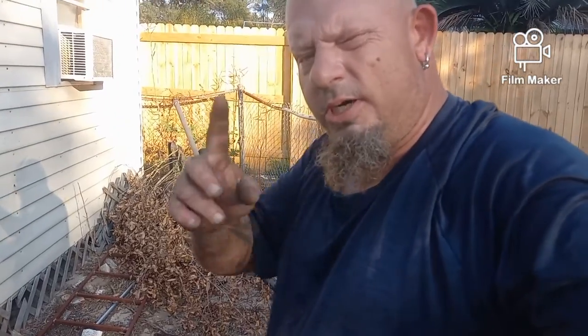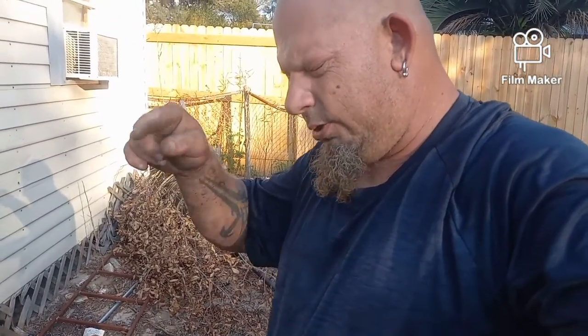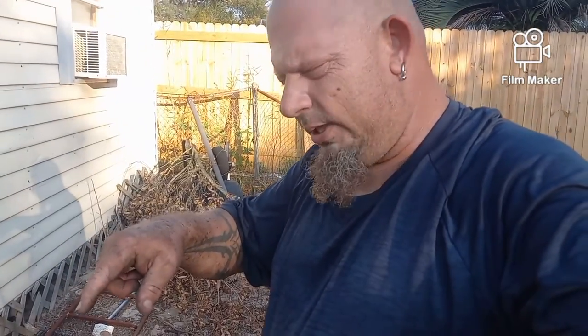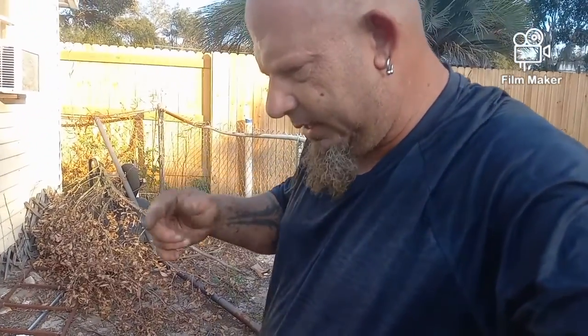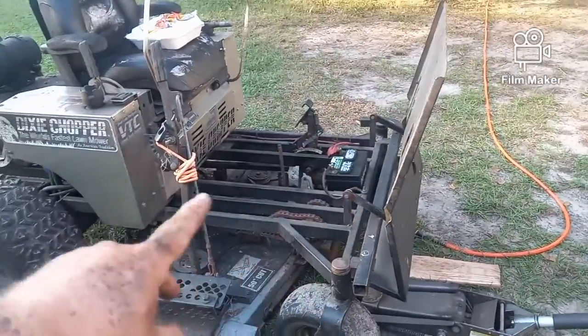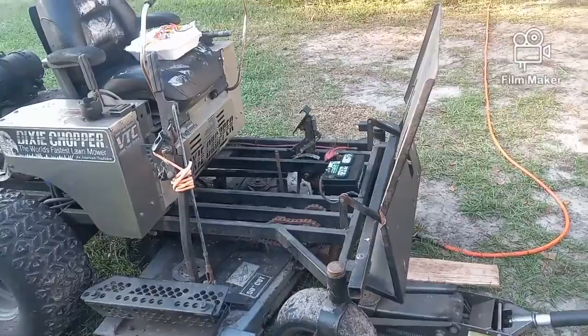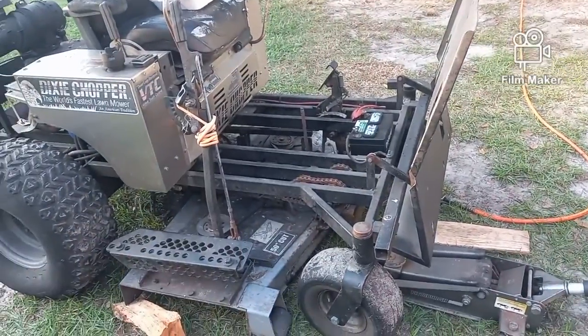You have the 2 bars that run front to back, one on each side with 2 pins in it, and you have to take out those 2 travel pins on the front, then take the belt off. It seems difficult, but if you go ahead and raise up your floor here, and you basically raise it and then pivot it forward and then raise it up, you can access almost everything from the top side.